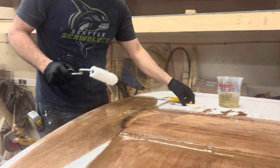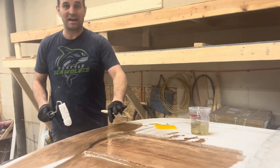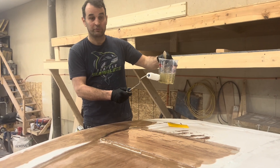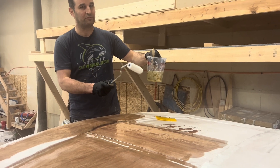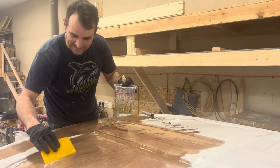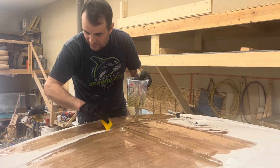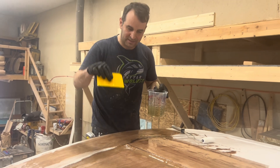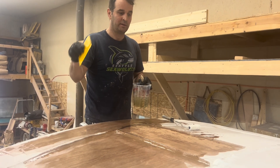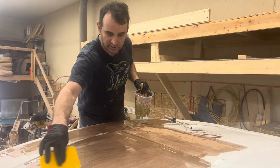I'll show you in the next video in a week or two. Here's the key: after this kicks and starts getting tacky in about two hours, I'm going to make epoxy with phenolic micro balloons — it's purple stuff — plus wood flour and a little cabosil, about 50%. We'll spread that to fill all of this grain. If you do that, you get chemical bonding and don't have to sand between coats. All you have to do is sand once and paint it — roll it good. You'll fill all your microsphere holes and have a pretty decent 10-foot finish.